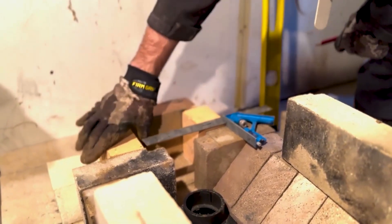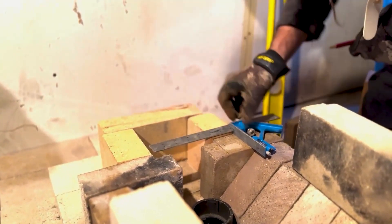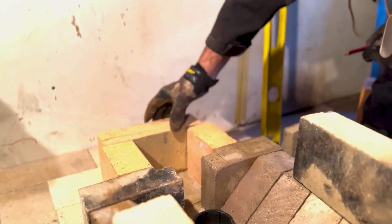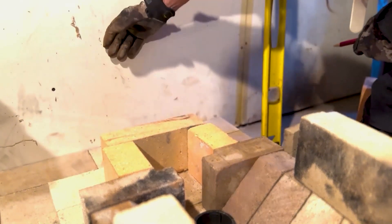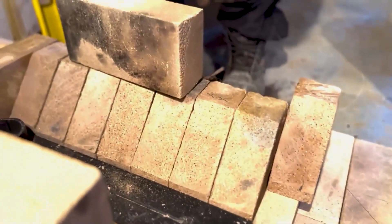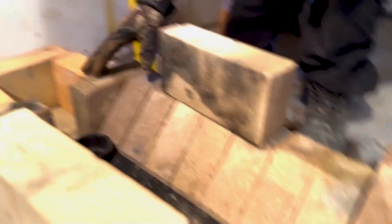We're using a lightweight fire brick for our chimney — it's more insulative, but it's also less durable. It's going to help keep our wall from getting too hot, but if I put it up here for instance, people throwing pieces of wood in here would damage it pretty quickly, so we don't want that.